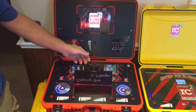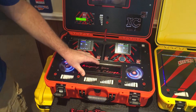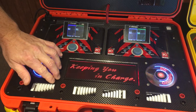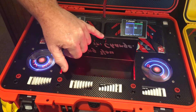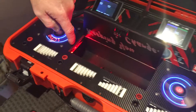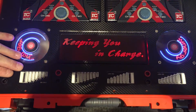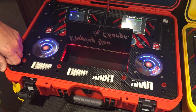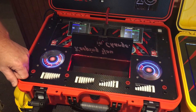The one thing we really wanted to do was be able to have storage with an illuminated logo. Chris cut a piece of half-inch acrylic, CNC'd it out, then stepped it, and built a frame out of the same carbon fiber material we use for the deck — giving it a nice picture frame effect. The acrylic is so thick it actually protrudes out from the bottom of the framework. We mortised red LEDs into the side of the case, so when you shut it, the light injects into the side of the acrylic giving a really neat effect. When you open it up, it actually lights up the inside of the box — handy for finding small connectors in the evening or early morning.